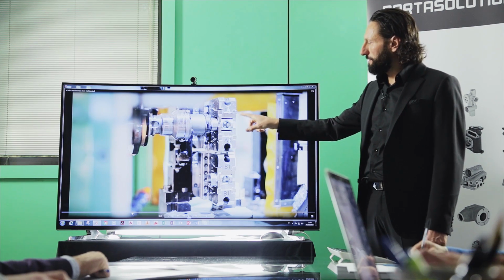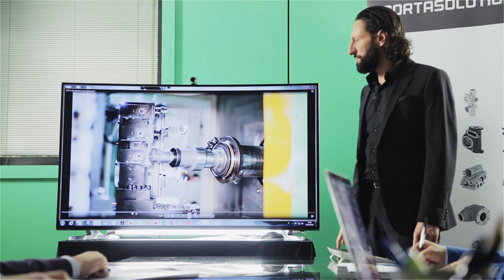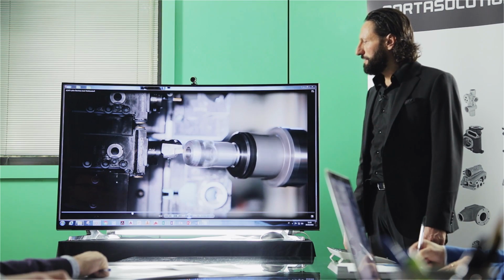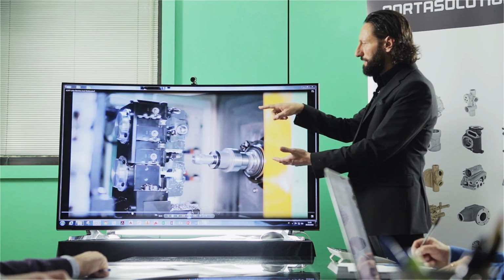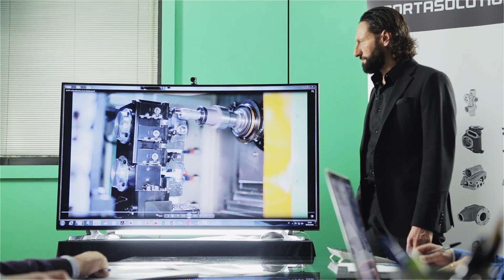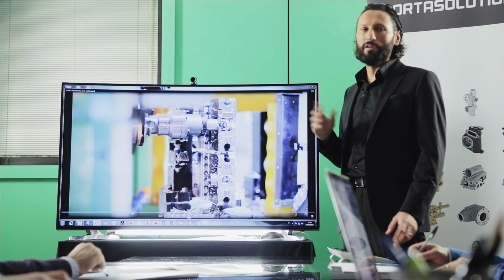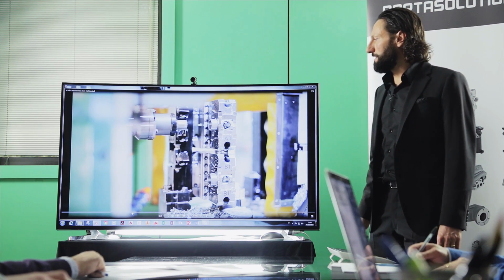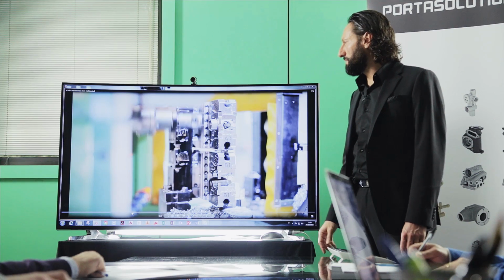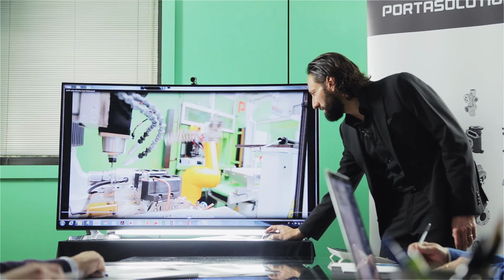We're going to open only the top chuck. And now on the B-axis, we have 3 lathe tools. So we put the part in rotation, and we do the turning operation, the OD. Then we can reorient the B-axis, like you see now, and we're going to do a chamfer. So this gives you a lot of flexibility. And again, it's a system that can also be implemented in a multi-center that was delivered maybe 3 years before. So the multi-center is really flexible also on reconfiguration. And this is the second part. And then there is the unloading, marking, and the rest of the process.